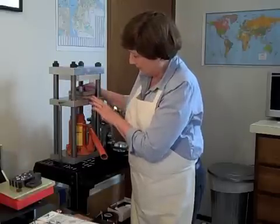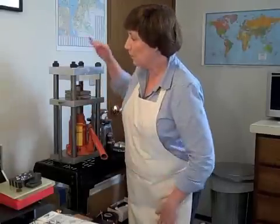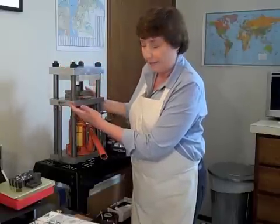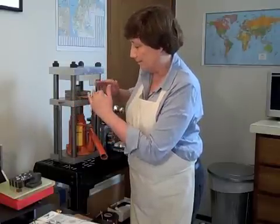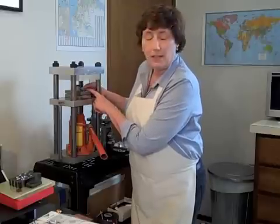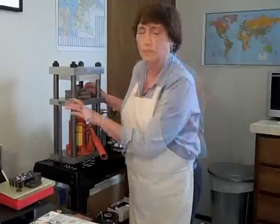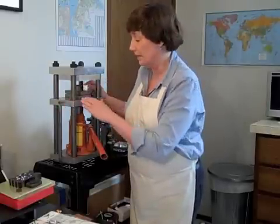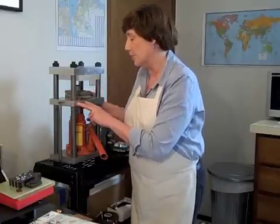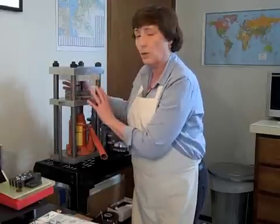How you use it with a hydraulic press — and this is very important — is that you want to center the cutting die. One of the most important safety features of the hydraulic press is that you always center your work. You do not ever want to have it off-center or pushing the bottom platen at an angle, because that angle will allow this very hard, very sharp, very heavy steel circle cutter to come out of the hydraulic press at a high velocity. It will come shooting out if it is ever uneven. So always visually watch the hydraulic press to make sure the platen is even and level, and that your tools and work are always centered.